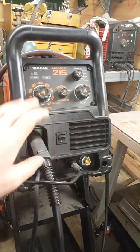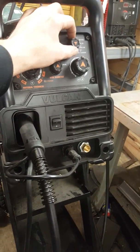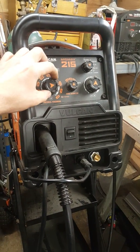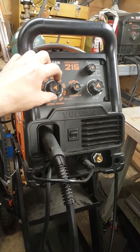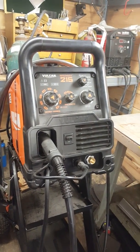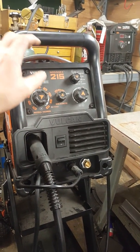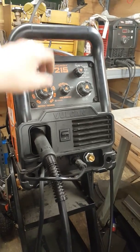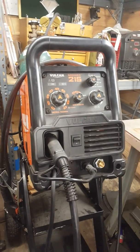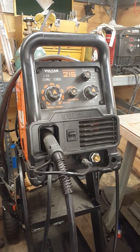From the settings it will automatically do for you — if you just set your wire thickness and then set what you're welding or what your wire is, and then just set your material thickness, it's really really close. Nine times out of ten it works fine for me. On 110 volt you can do almost three-sixteenths as far as the auto-set goes. Once you go to 220 you can peg it. Manual is obviously what you want as far as speeds and feeds — everybody understands that.